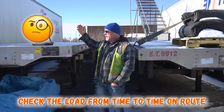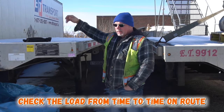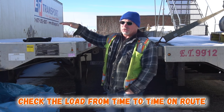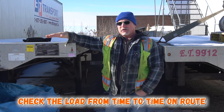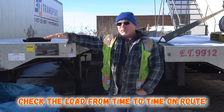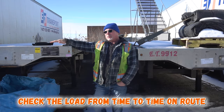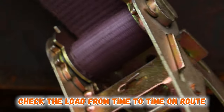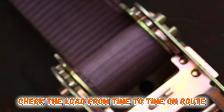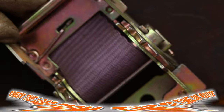Especially if you can't get your deck fully cleaned off. Say that's ice and you go do your pickup — while you're at your pickup, that ice may be underneath the wood or dunnage they put underneath. That gives that extra chance of product moving. So you really have to make sure you get that cranked down good and winched on. Then again when you get to your next stop, you're going to want to get out, fix your binders, make sure everything is still nice and tight and that product hasn't shifted at all.